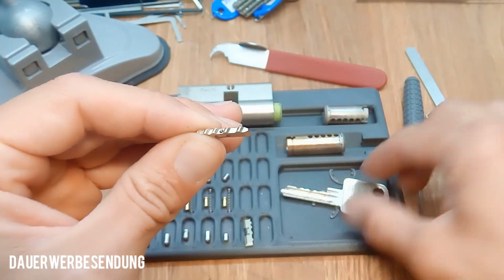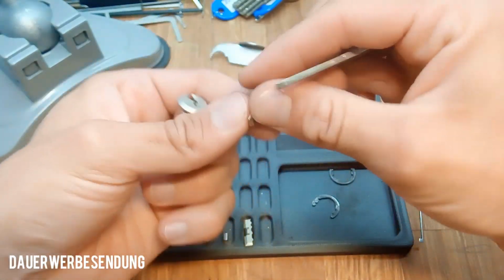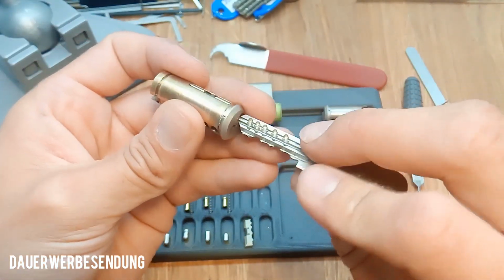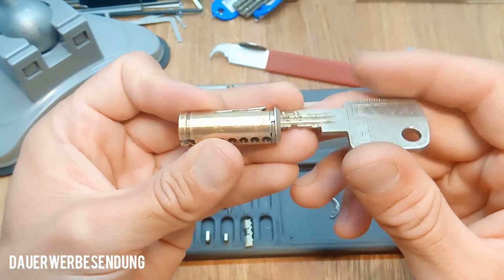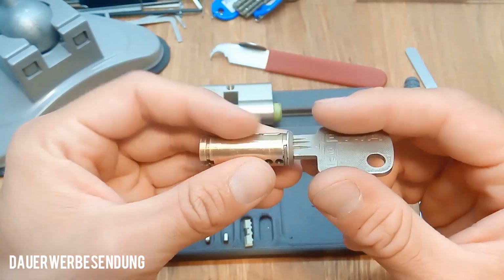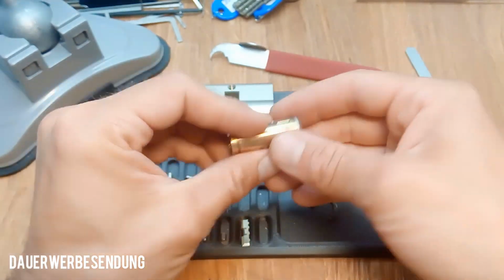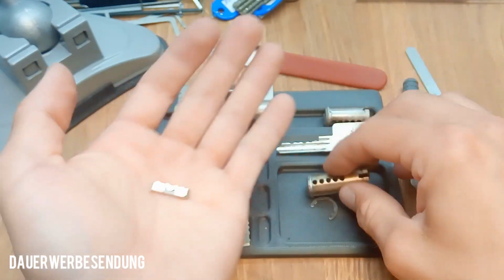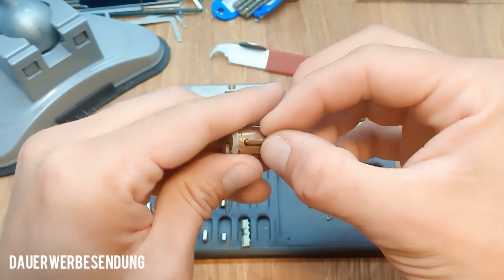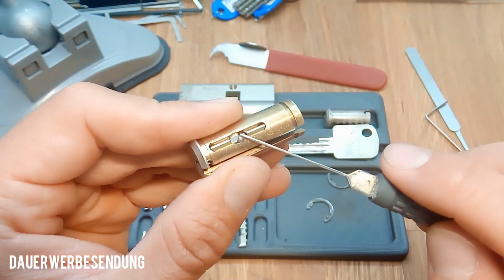And these grooves will interact with these grooves on the key, and when everything is correctly assembled, the sidebar sits in like this. When the key is, for example, not all in, it sticks out a little bit, and when it is all inside, then you can see that the sidebar drops inside the core, and the core can now rotate freely in the lock body. So what happened when it locked up again was that, let me put it back in to show it better. In this little groove that you can see there, that drops the third driver pin.